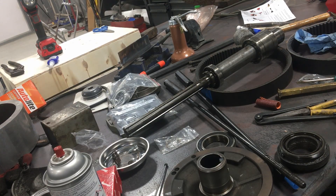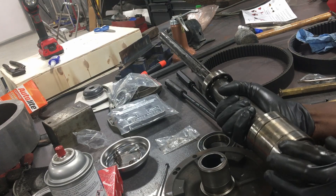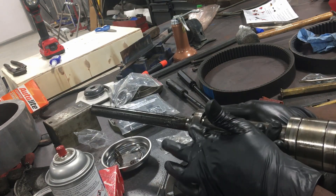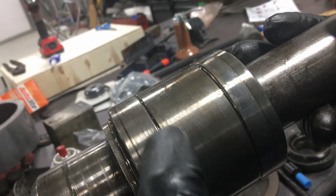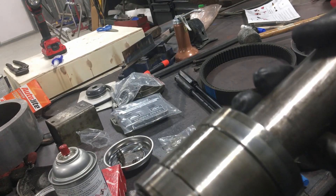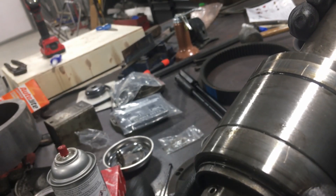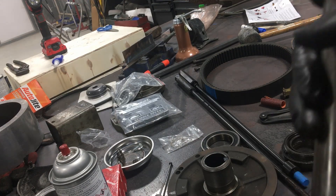Okay guys, so we are looking at my spindle — got it out, my son assisted. So these two are the precision bearings, the spacer, another spacer, and then a bearing up here. There are some surface blemishes, nothing crazy. We can clean the direction — seems like it was spun within the housing a bit, but about what I'd expect out of bearings.